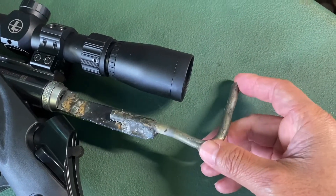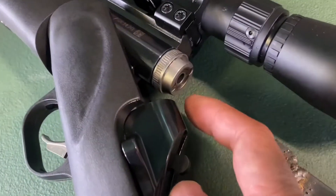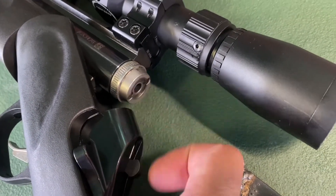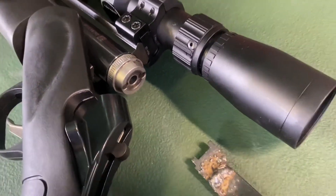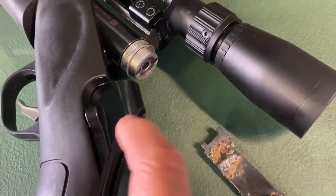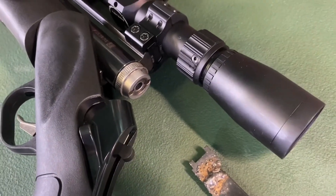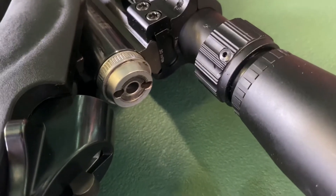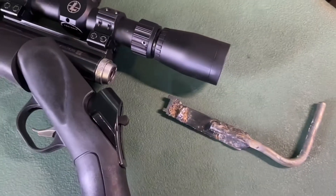The other thing they could have done is just drill two more holes in the breech plug so you could clock the wrench better when you run out of room — when it hits the scope or the end of the breech. Right now they only have two holes, so you run out of room. That's all — fixed it.